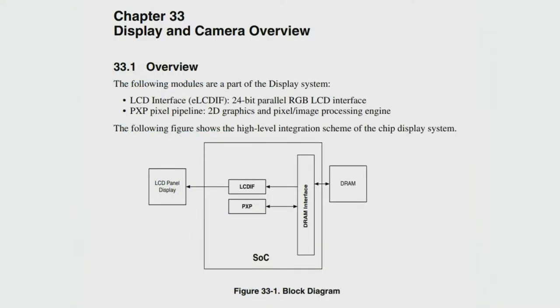For the display, there's no camera but there is a display controller. You can mimic a camera with FlexIO. For display use, you do need a frame buffer, so you'll have to wire up external DRAM. On the eval board you can see there is DRAM already, so you can follow their layout. You're going to use a bunch of pins for that, and a lot more pins for the 24-bit parallel RGB LCD. It's pretty rare to find an inexpensive processor that can drive a full TFT display — this one has a large number of pins but they're easy to route.